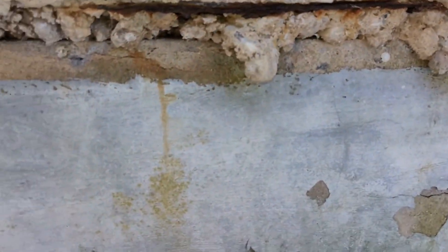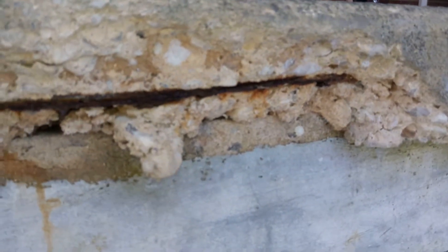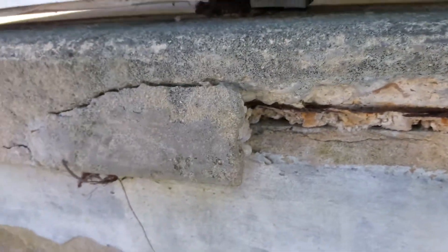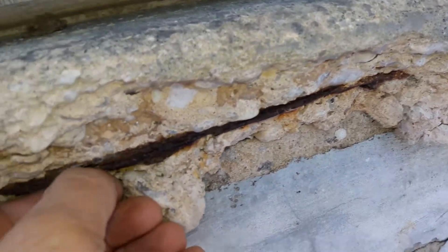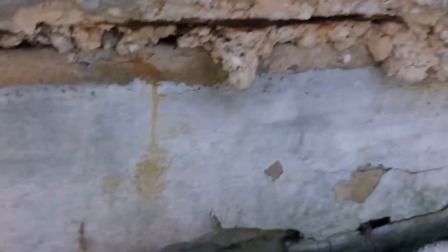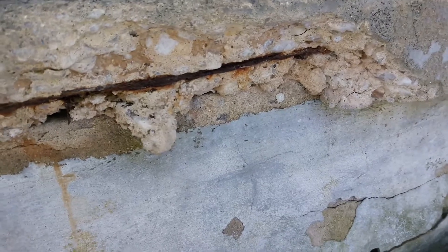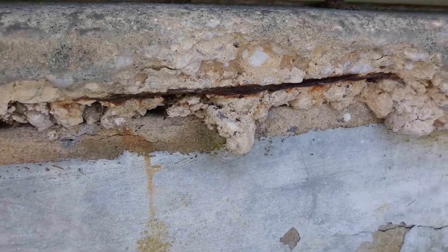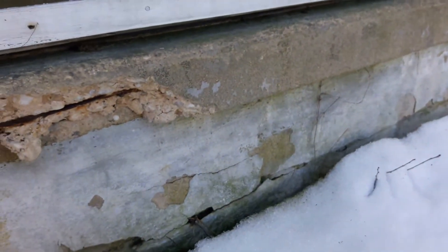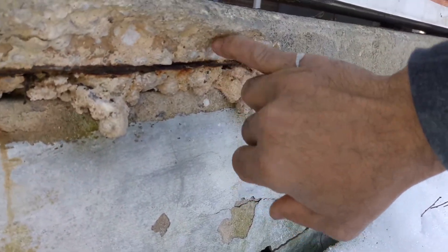Here's our reinforcement — look at that metal. That metal got water on it, it rusted, and when it rusts it expands and breaks apart the concrete. Do you tear apart the whole porch to do this? No, not at all. You can feel the cable — it's gone, it rusted. It's just a wire mesh. This section was able to get wet, the metal expanded, and that thin wire mesh caused failure of this entire end of the porch.